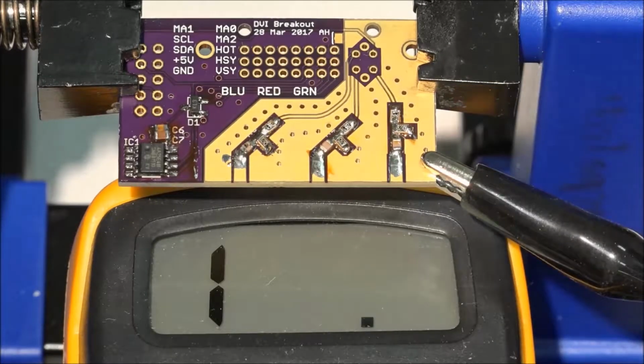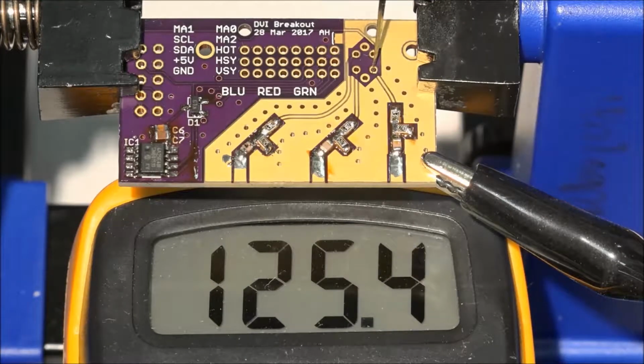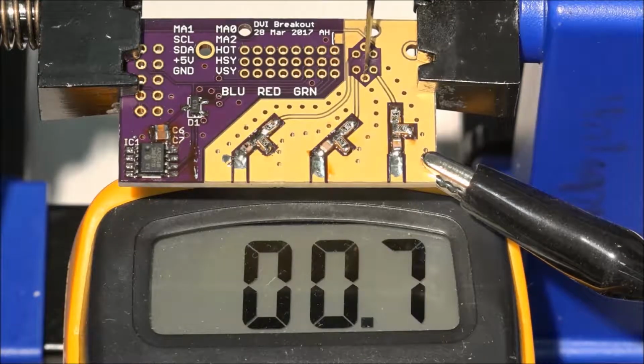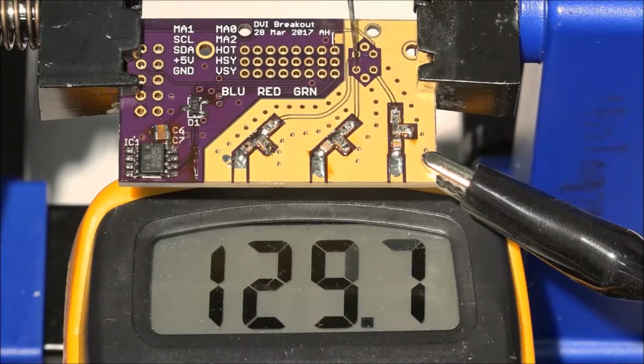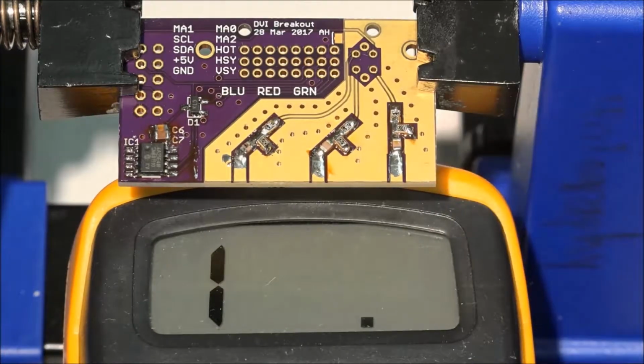Once that's all done, get a multimeter to measure resistance. We'll check to make sure there's about 130 ohms between the RF source and ground on each channel. The meter indicates about 125 ohms here because some imperfect parts were being used. These were later replaced with the correct ones that read about 130 ohms total.